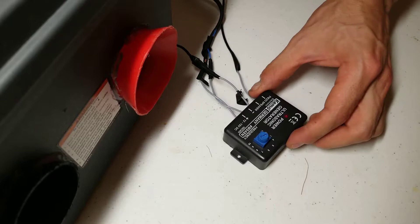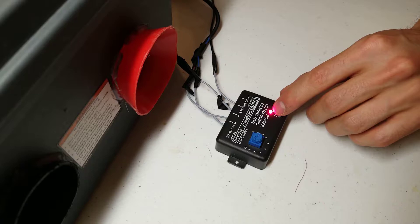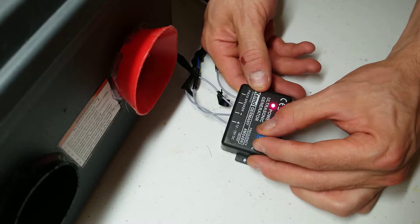So now I'm going to flip the switch and show you how this can work. As you can see, this lit up. When this is lit up, it means there's a load on it, and the piezo speakers are outputting signal. This can still be outputting and not be lit up if there is a very low power signal. When I plug this up to an amp, it does not light up because there's not a large load on it. I'm going to lower the frequency so you can hear it through the video. You can play with the frequencies to make it completely inaudible.